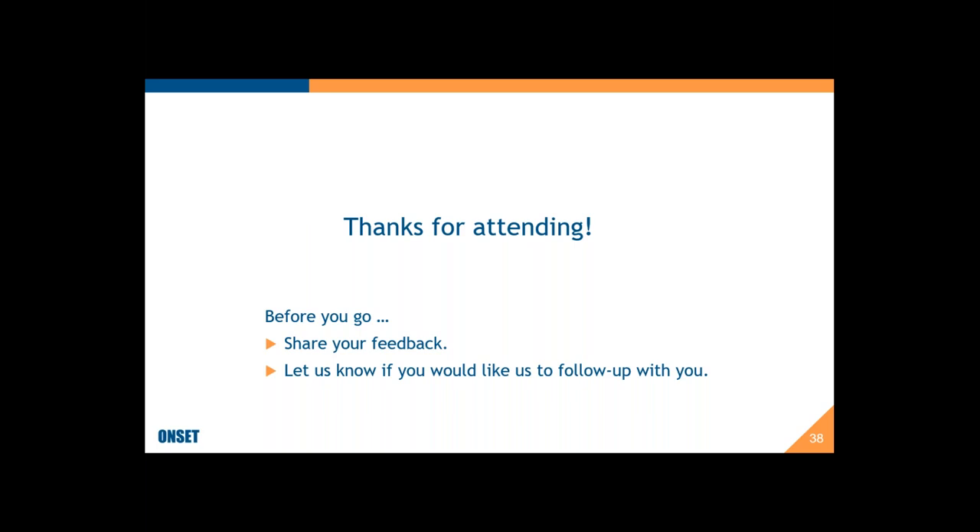On whether the U20L is appropriate for estuary and saltwater: absolutely. It's made of polypropylene with a ceramic sensor, and we have many users deploying them in saltwater bays and estuaries. So it's very appropriate for deployment in those environments — you want to make sure when you buy these that the materials meet your deployment environment.